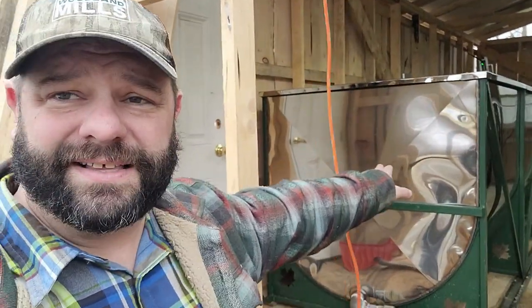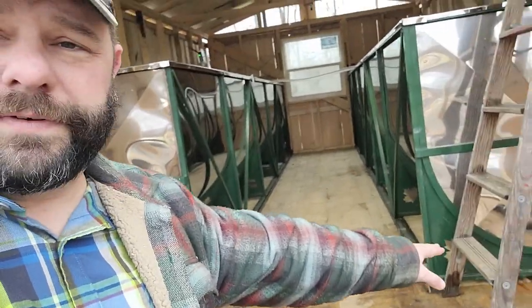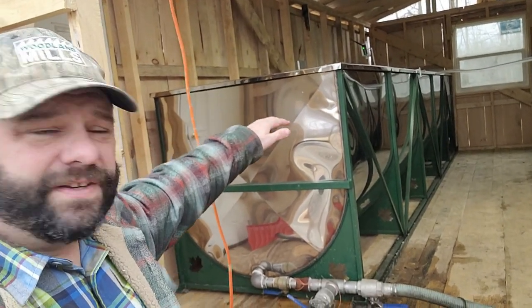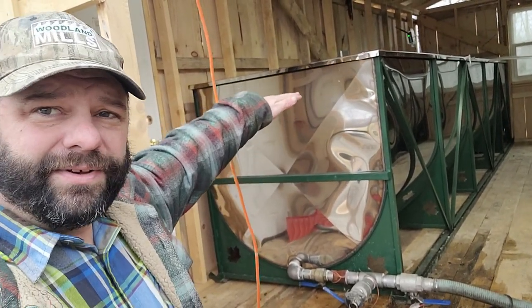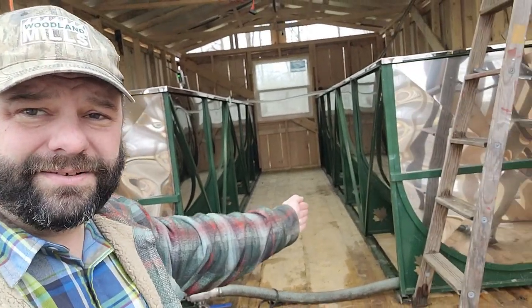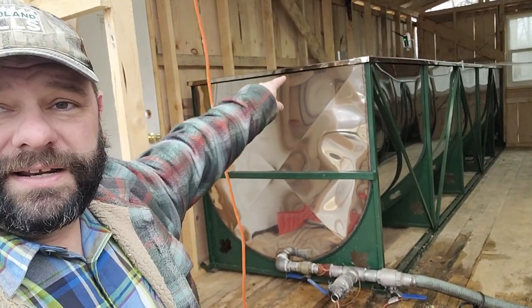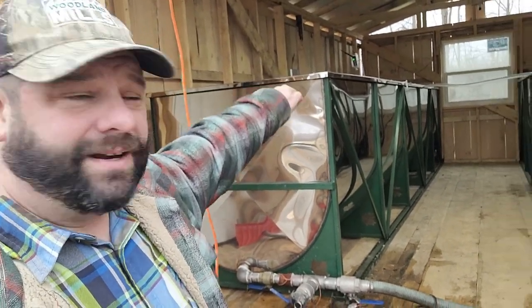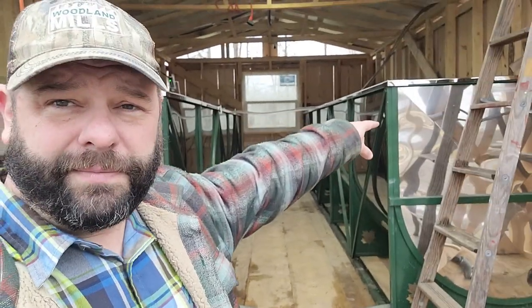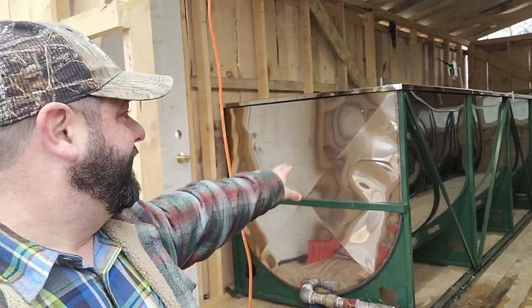So there's 2,000 gallons here, 2,000 gallons here, and there's no valve over here. So what'll happen is when this tank fills, as it's filling up this way, they'll equalize. The pressure will push down and it'll run into this other tank and they'll be about the same level. Now, if it's really running in, this tank will usually be higher than this one. So you can get to the point where you still got a little bit of freeboard on this tank, but it'll actually start overflowing on this side.